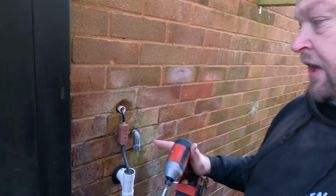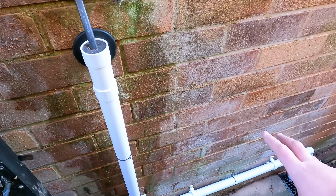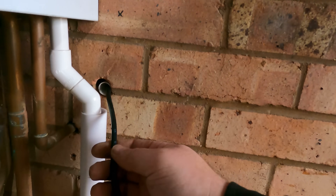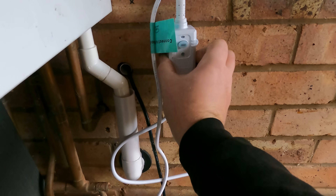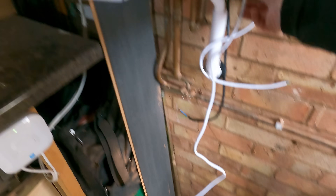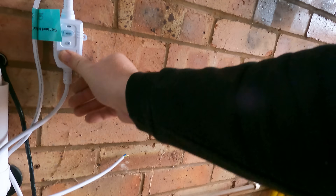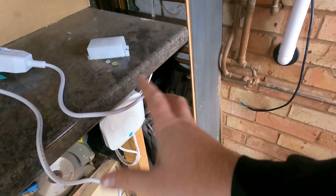I've put the thermostat kit on the outside now — put the cable through, plus a little bit of overflow, but we're going to seal all that in so it looks nice and neat. Externally we're near enough done; all we've got to do is put the lagging on at the end. Let's go inside and get the cable in and the wiring done with a live feed from the boiler. Back in the garage — this is the cable coming from our stat outside. We've got to connect it into this unit here, which is like a test unit with a reset button and a test button. We'll mount it on the wall so it's accessible to reset if and when needed. This side of the cable is about two metres long and goes to the permanent live inside the boiler, or it can go onto a plug top.